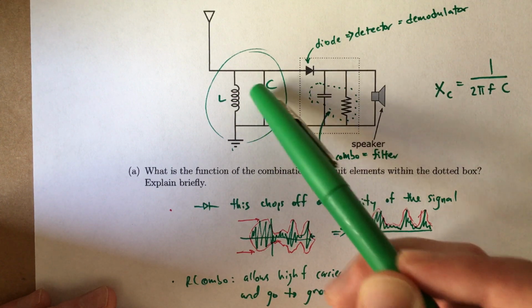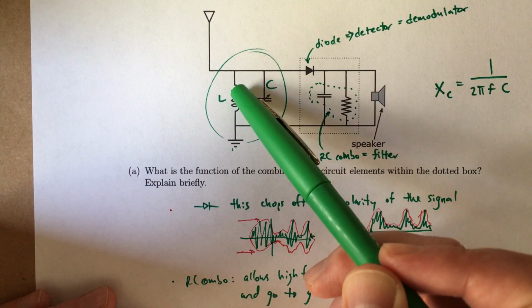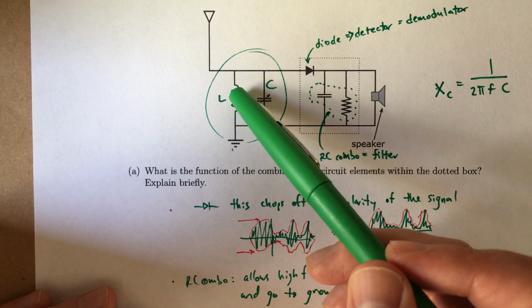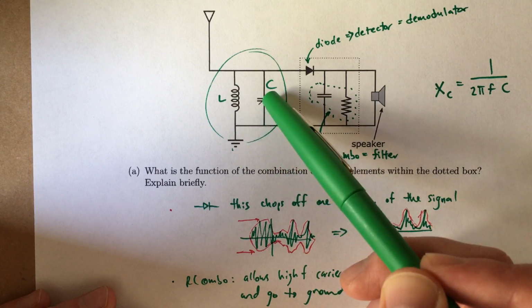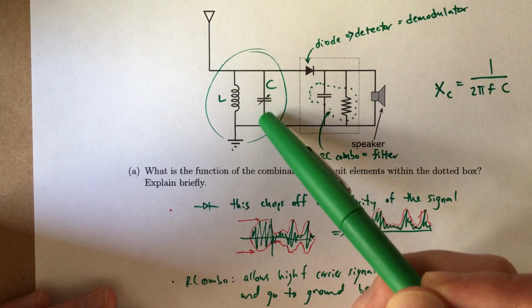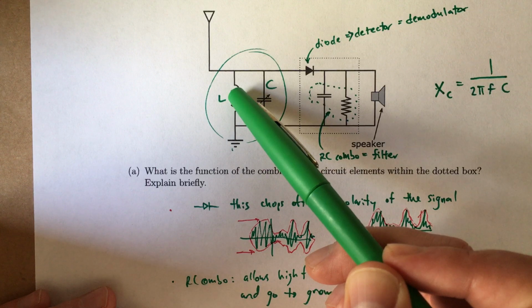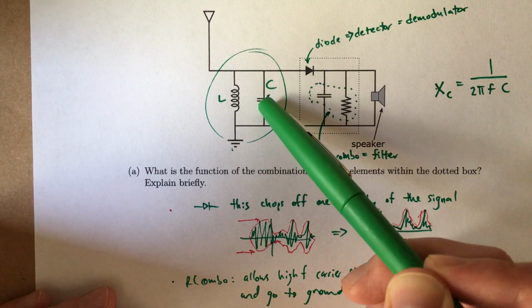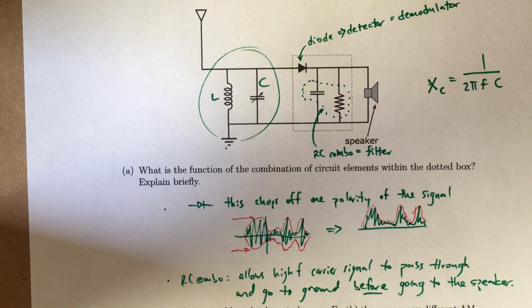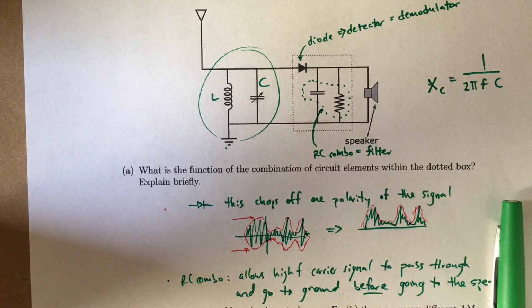But eventually the capacitor runs out of energy, and then the inductor here tries to prop up the current that was going through it. And so it drives current in the circuit, and the effect of that is to recharge the capacitor, albeit with the opposite polarity of voltage it had when we started the process. And then that drives current back the other way once this thing runs out of energy, right? No more current flowing for a moment, and this thing is all charged up. And the current comes back the other way, and the whole process happens in reverse. And so that oscillation in energy from the electric field of the capacitor, that separation of charge, to the magnetic field of the inductor caused by the current going through it, goes back and forth and back and forth at this resonant frequency.